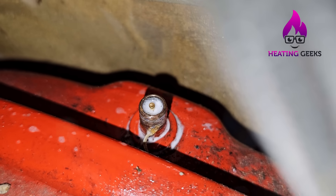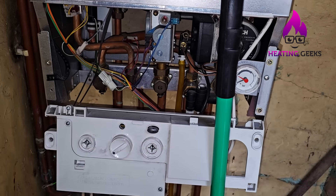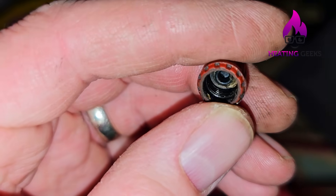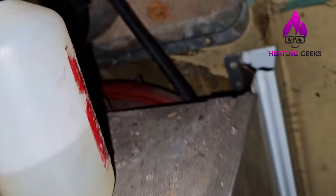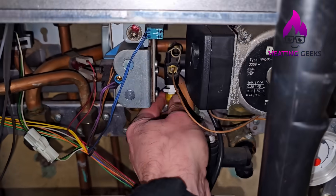Get a cap on that, get this boiler filled up. One other thing to mention: there is a rubber seal around the outside of that Schrader valve point. If it lets by a little bit you can tighten it to get by if you haven't got a core. Let's close the drain for the second time now.